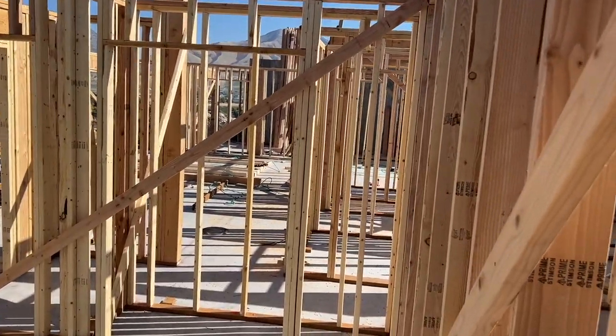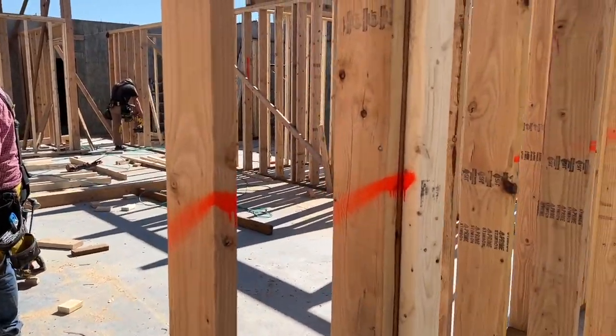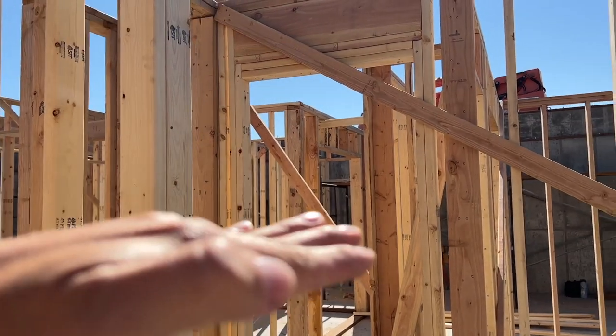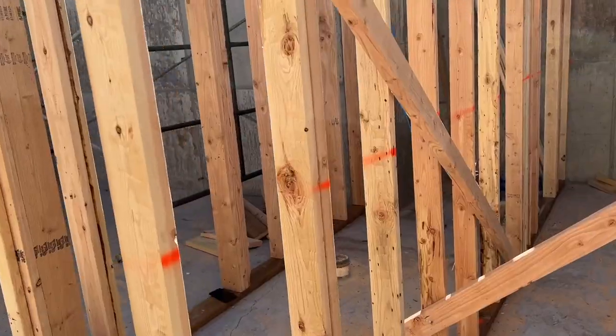There's nothing like a lumber delivery. As you can tell, the framers have made a drastic amount of progress on this house. One thing they've done is mark with orange spray paint where structural material needs to go. The engineer has taken racking into account because the house goes up three stories — we need to make sure the perimeter holds the house in place, and the interior walls take the load but also hold it laterally. This orange paint says this is a shear wall. Shear walls require certain hold-downs in the floor and not just sheetrock — they require OSB sheeting to laterally hold that wall stiff and rigid. Once you put your lateral bracing on, which is your sheeting on the outside, it becomes very rigid, and they want that on the inside of the house too.